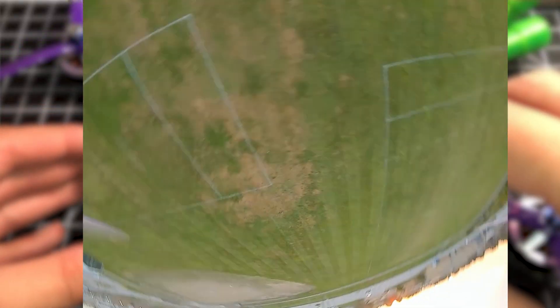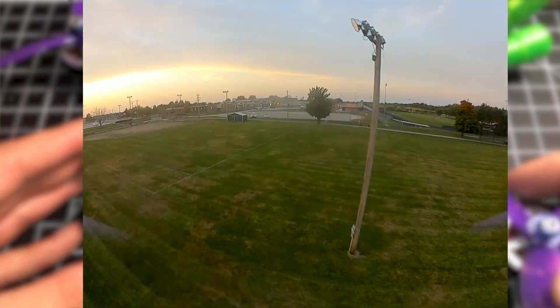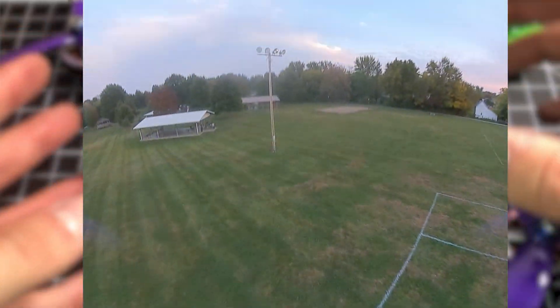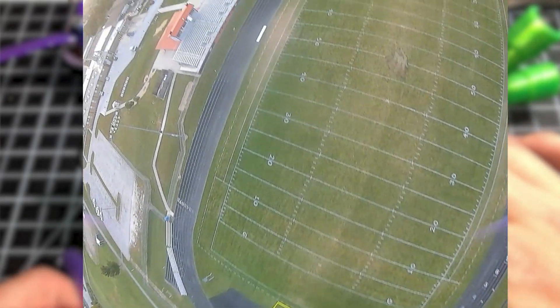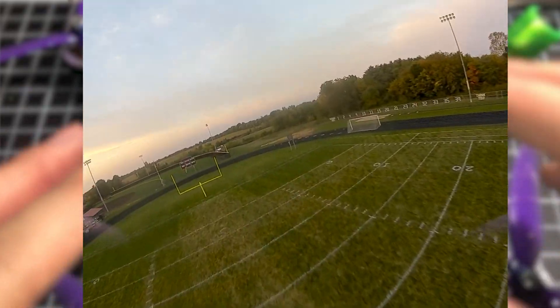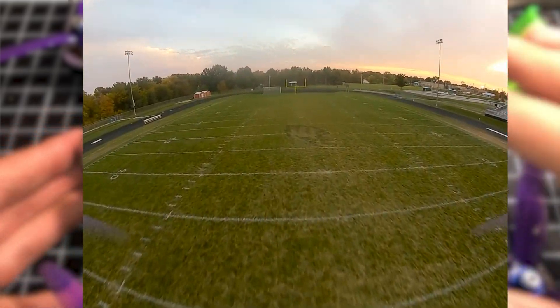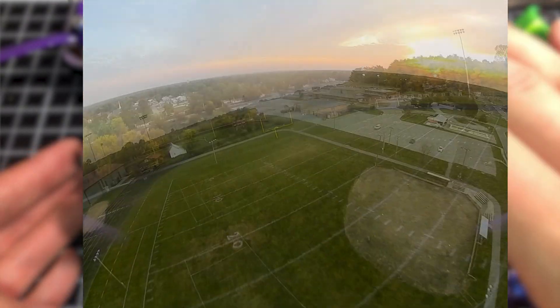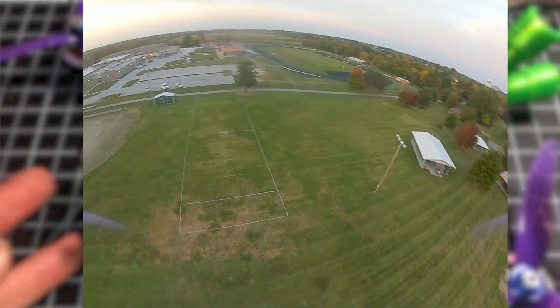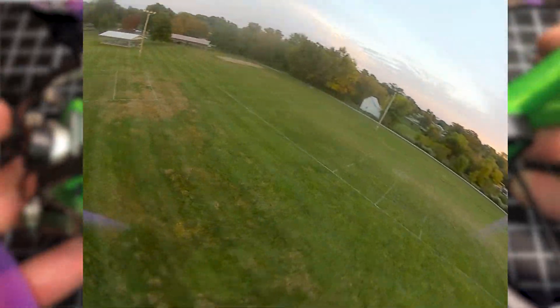I think I got the tune more or less where I want it. I'm not seeing any crazy wobbling or super shakes — it's just decent, I like this. More importantly, the DJI air unit has been flawless with the onboard 9-volt regulator. I've not experienced any problems — full throttle up hard, burn it up real good, no freezes. It's very important that the air unit has clean, reliable power or you're going to have problems. I'm happy to say this has been performing fantastically in that respect.